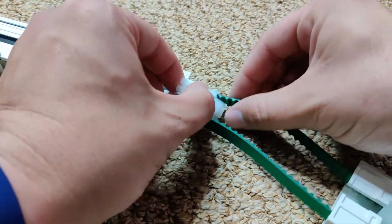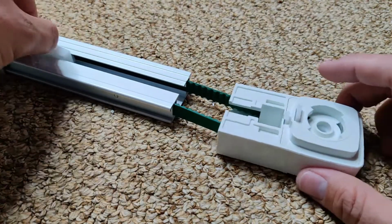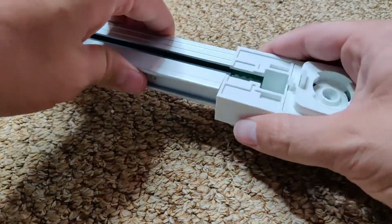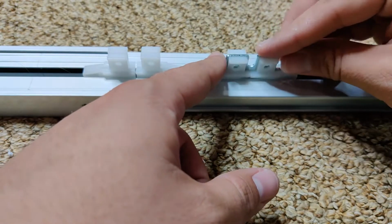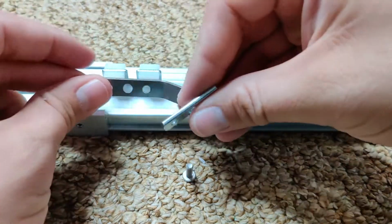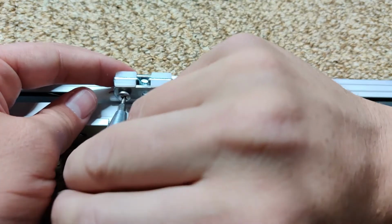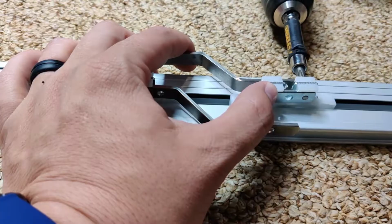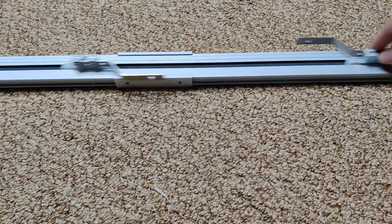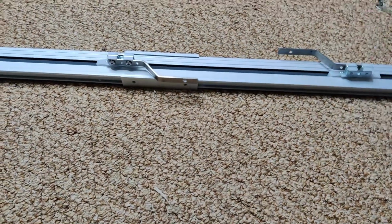After this, you feed these ends through the track as well, and the tension on these belts pulls the ends onto the track. After that, the hardest part is done. Next, you have to add brackets to the buckles at the end of each belt. These brackets tie the ends of the belt together at those buckles and allow both belts to move as one belt. After this, you test out the track to make sure it's running smoothly and that you hooked everything up the way you were supposed to.